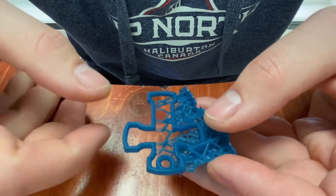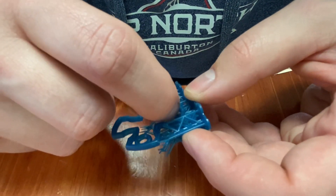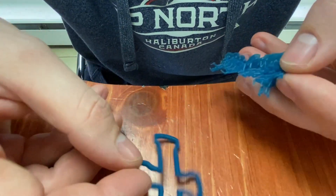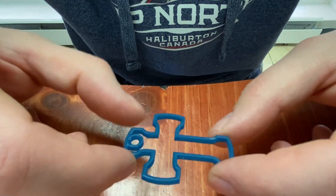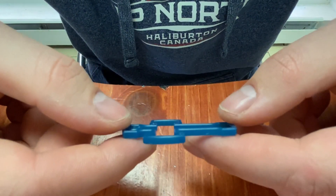This resin is very, very interesting — I am very surprised. I don't often get surprised because these resins sometimes feel like they're just packaged under different names, all the same stuff ultimately. But that's not the case here; this is a very interesting product and I like it a lot. I ran settings of around 10 seconds per layer with a 40-second initial base layer. The Apply Labs website doesn't have specific profiles for all their resins — at least not for the castable.